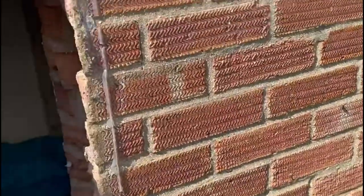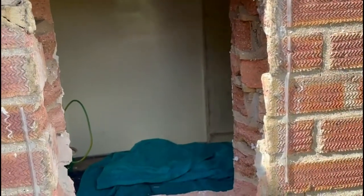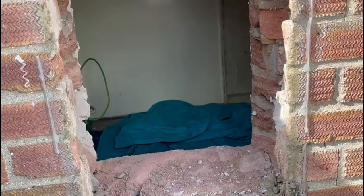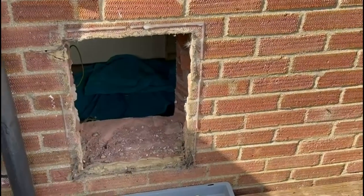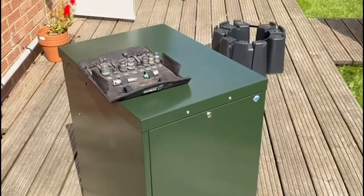Once I've done the brickwork, I'm going to crack on and start pulling up the flooring to get our base in. Adam's just popping upstairs finishing off up there — there was no bypass in this job, and with a Sapphire you've got to have a bypass or it'll just overheat. He's also taking the circulator pump out of the system and going to install it on the other side of the wall. All in all, half past nine, we're doing very well. We love a Sapphire.